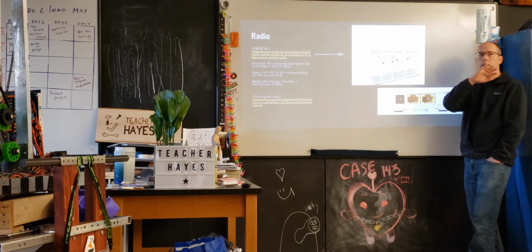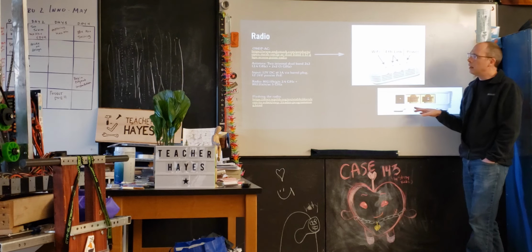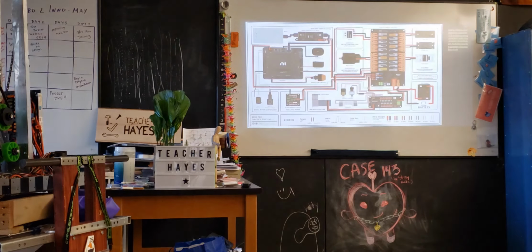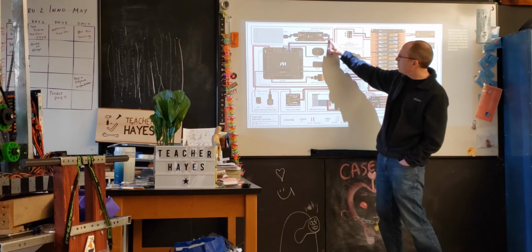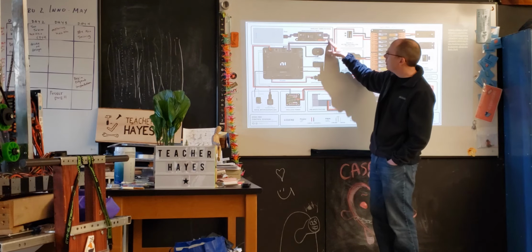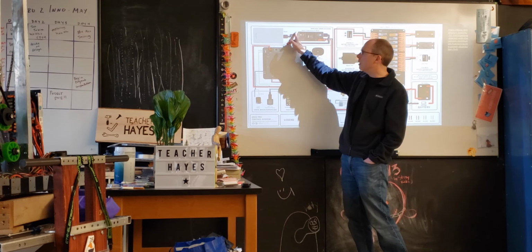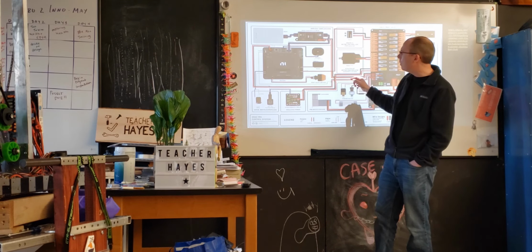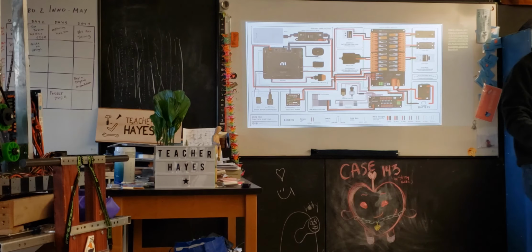Most of the connections that you have in here or other places are typically not PoE. They're typically labeled very explicitly as such. In our system, what we do, and you can see it in a second, is this little converter that's sitting here takes the voltage from here, essentially puts it onto those pins. It passes the signal pins here. It adds these to the appropriate power over Ethernet pins, and that powers this radio. You could, and we have at different times, power directly into that other port, but we often use the power over Ethernet one. You could go either way.